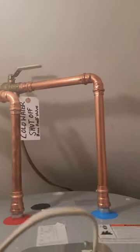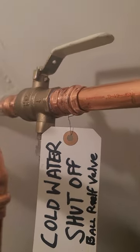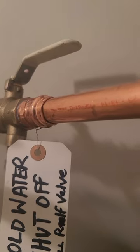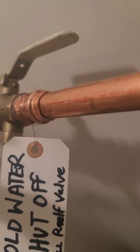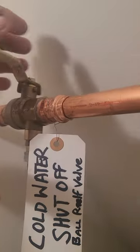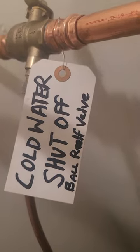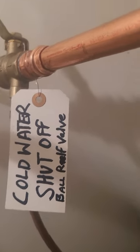You can clearly tell there's no room in here for a thermal expansion tank — so tight. So what this does is if it ever builds up thermal expansion, that's a relief valve built into the water line, and you can see we're downstream right there. They still have the ability to shut the water off like normal. However, if there's thermal expansion, the excess energy just goes straight down to the drain.